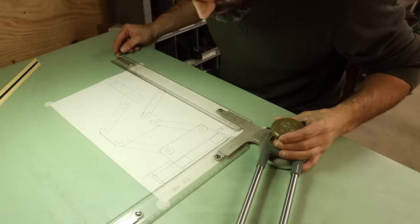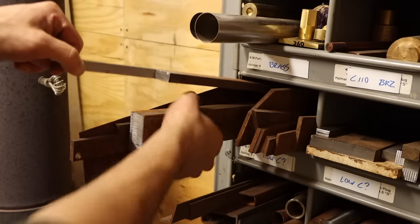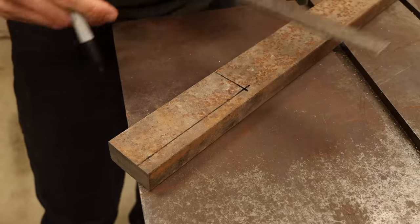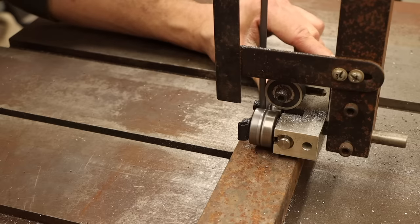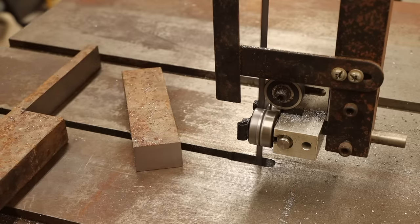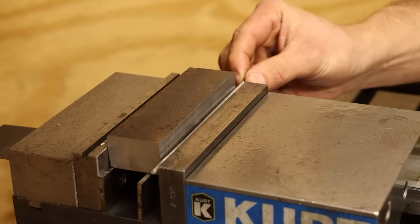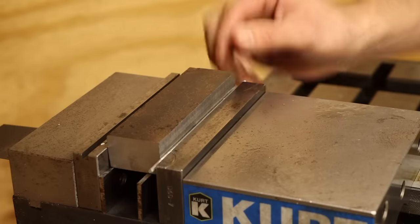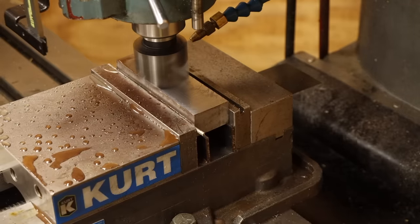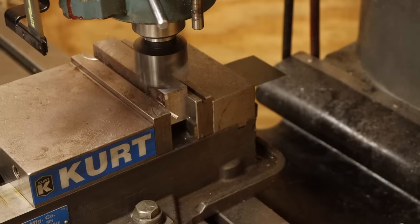Which should be interesting. I have a lot of work to do, so I'm just going to jump right in — and might as well start on one of the more complicated parts: the handle. Which, despite my cutting out a piece of square steel, will actually be mostly a round component. Going this route will save me from turning a lot of good metal into chips. The first step is to mill the four long sides square to one another, but I'm not going to bother with the end quite yet — and you'll see why.